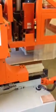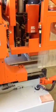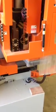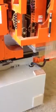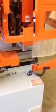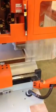As you're looking at the machine cutting this miter fold, know that there's a three-quarter inch wide piece of 3M clamping tape directly underneath the joint, and the tip of that bit is leaving about five thousandths or so of walnut veneer on the face side of the sheet, plus the thickness of the tape. So the tape is completely intact, and a little bit of wood right underneath that joint.